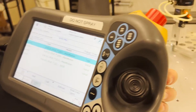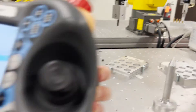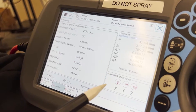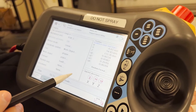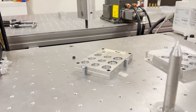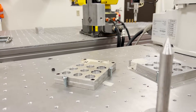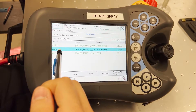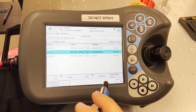To ensure that we are moving in the correct work object frame, we will go back to the jogging screen. Change the coordinate system to work object and ensure that the work object is plate 1, the work object we just defined. From this, we are in linear motion mode. So we will now more easily be able to jog in the positive X and positive Y directions. Repeating the same procedure we used to define the plate 1 work object, repeat the same steps for plate 2 work object, so that we can easily maneuver between both work objects while performing our pick and place procedure.